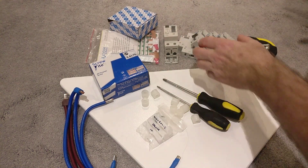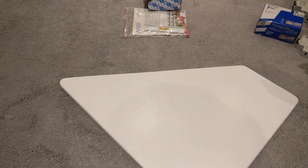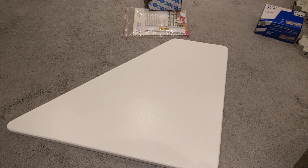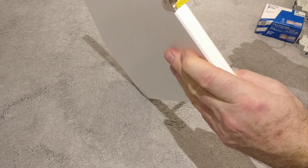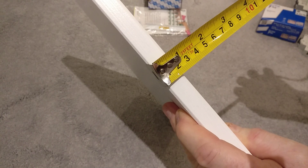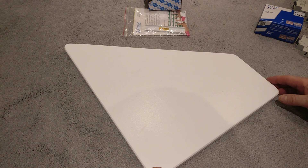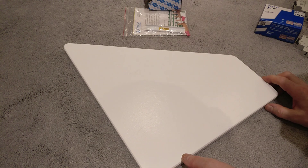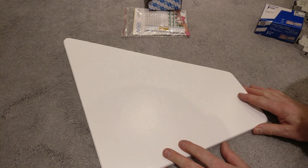So let's move some of these things out of the way first. So first of all, let's have a look at the board. This is just a piece of pine board — I think it's about 18mm thick, it was an old shelf that I had lying around. All I did was make a paper template, put that in the space, transfer the template onto the board, cut it out, and put some nice curved edges on it so that it's an exact fit for the space I've got on the wall next to the original consumer unit. Then I've just painted it in primer and a top gloss coat.